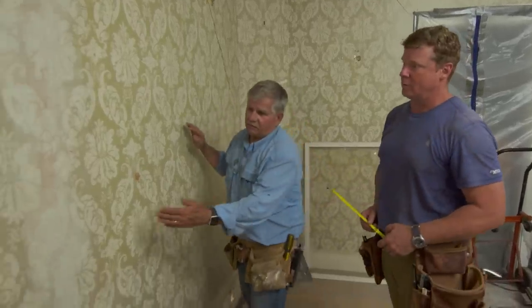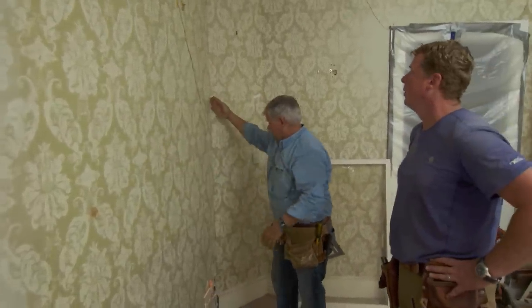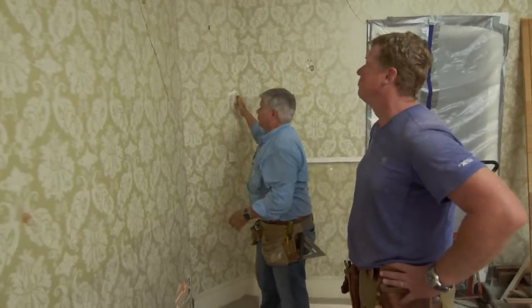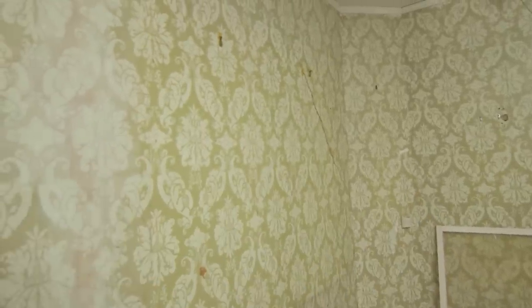There's such little plaster left — I've got a little section here, a little bit over here, and this is all split and cracked. We're either gonna strip this wall right back to this corner or to this corner. It all goes, and in with new plaster. We're gonna start on the other side and put our header in and cut for our jacks.